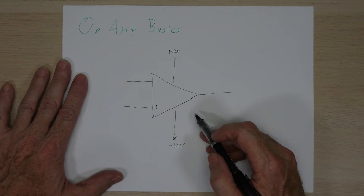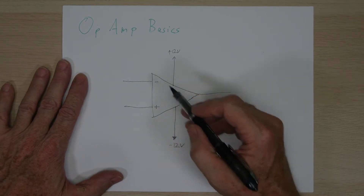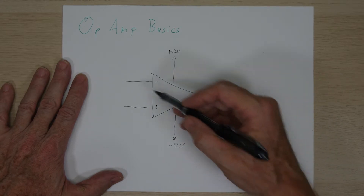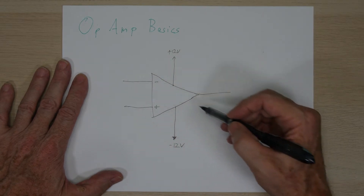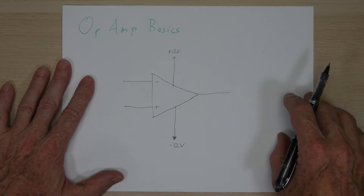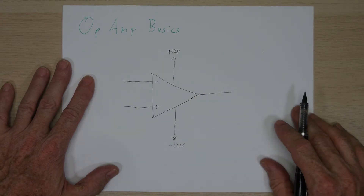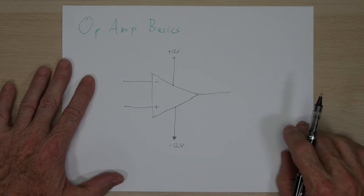This is how an op amp will typically appear in schematic diagrams. While we see a minus sign and a plus sign on these two inputs, they do not indicate negative and positive voltages, but instead they indicate whether the output will invert the voltage seen on the input — in the case of the negative one — or maintain it in the same polarity on the positive input. Sometimes you'll see the voltage supplies drawn in at the op amp symbol itself. In this case, positive 12 volts and negative 12 volts — the typical voltages you'll see in a Eurorack system. And then this is the output of the op amp.